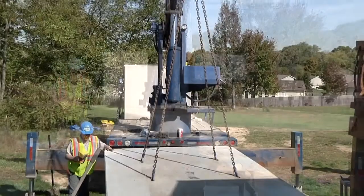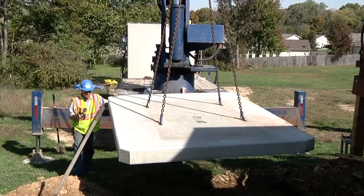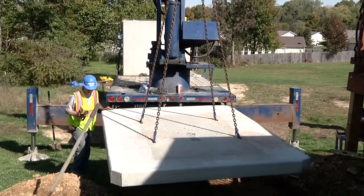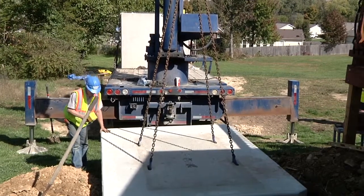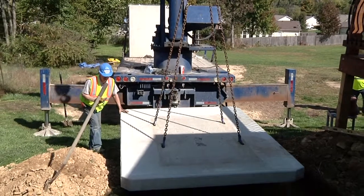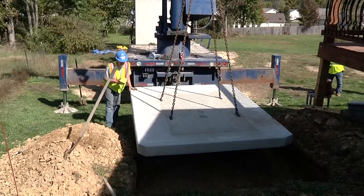In Henryville, setting an epoxy-down 30-60 shelter. The excavation was put into the hill to allow the shelter to come out at ground level. The customer has been talked to and is going to put something behind the vents to keep the vent space open and set the base.